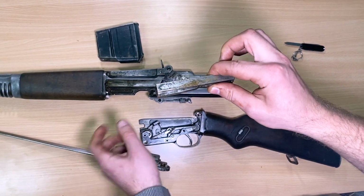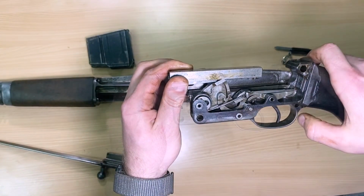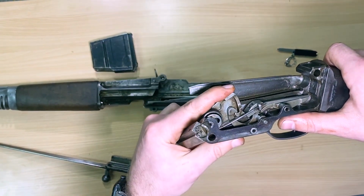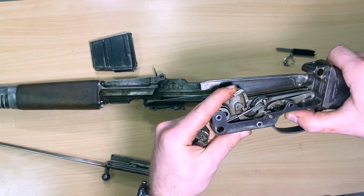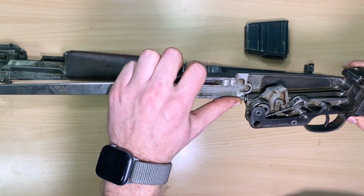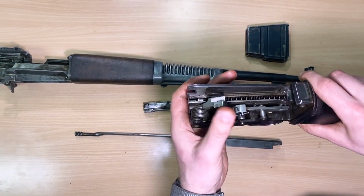And if I take only the bolt out and show you here, so this is the position of the trigger when it's locked, but when you press a little it makes space, so the whole bolt goes forward, and actually this angled surface pushes the hammer down, so you can release only the bolt and release the trigger later on and fire with that. So with the recoil spring being here, it's actually pushed by this edge on a bolt carrier, pushing here, and yeah, that compresses the spring and makes the cycle go back and forward.